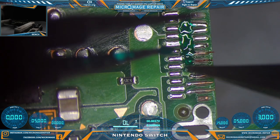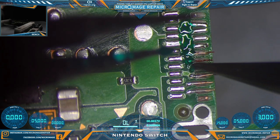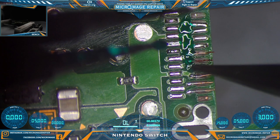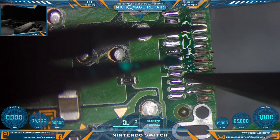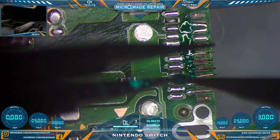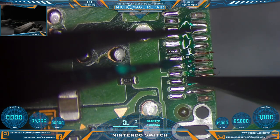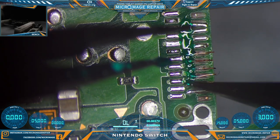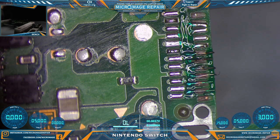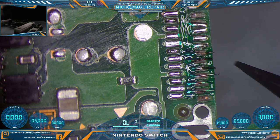But ideally, we would like them not to move. Well, not just ideally, you 100% don't want them to move. So the solder mask helps secure them in place, even if the solder wets, they won't get sucked up into the port. A good cure is very important here. Okay, that's relatively what I'm looking for.